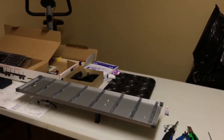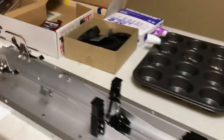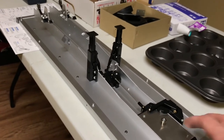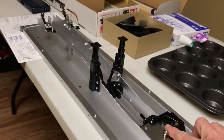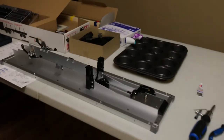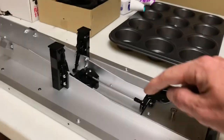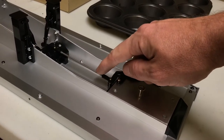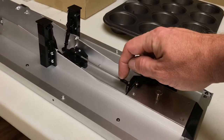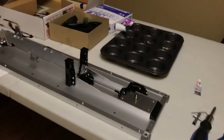So there's the build so far. The legs on here — if you pull them up when you back the truck in, there'll be another piece where the hitch hits this and automatically retracts the legs. So when you build those, make sure they're functioning before you get everything mounted up. There's a metal rod and linkage here that goes to unlock those springs and let them spring open.